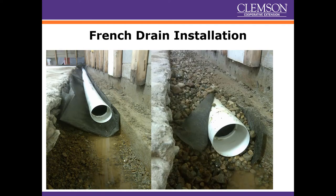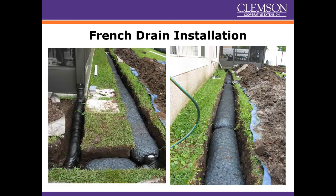For French drains, wrap them in geotextile fabric — available at drain supply stores, landscape supply stores, or farm supply stores. The holes in the pipe face downward: water infiltrates the gravel, comes up through the bottom of the pipe, and then flows out the pipe — that's what it's designed to do.